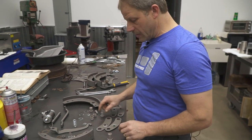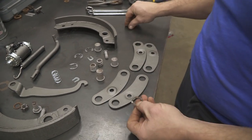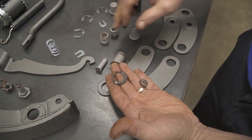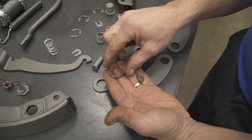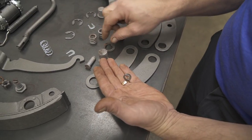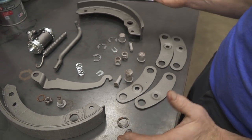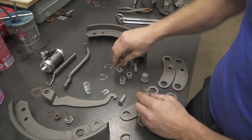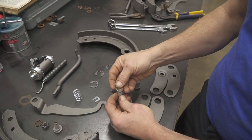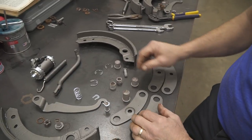Another slight snag: these are the stock clips. You can see in both styles of pins they have this undercut or groove, and the clip would slide in and lock in place, not allowing the pin to just slide out. Problem is they don't manufacture these any longer, so I had to come up with a slightly different idea. What I decided was this more common 1960s horseshoe clip will be perfect here — you slide it on, pinch it together, and that solves the problem with the smaller pin.